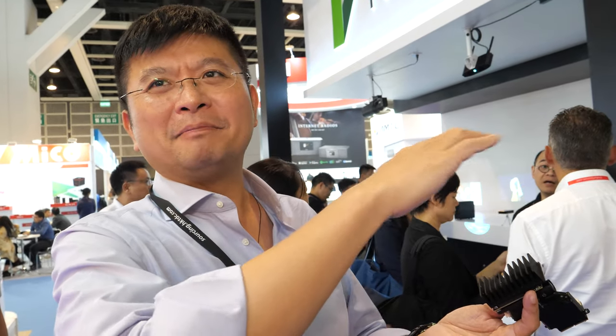I did so many videos about DLP, but I still don't understand how it works. Oh, I think this is a micro mirror, right? This is a CMOS process. There are millions of small mirrors. Yeah, exactly, with multiple layers of coatings, so the manufacturing process is so sophisticated and delicate. The fab must be amazing. Exactly. You probably visited? I didn't visit, but about 20 years ago, I heard the yield was very low, even single digit. But now I heard they make it with very high yield and very efficient.